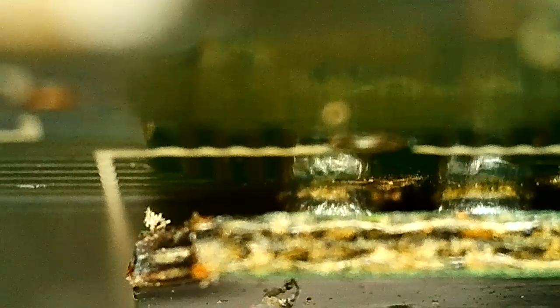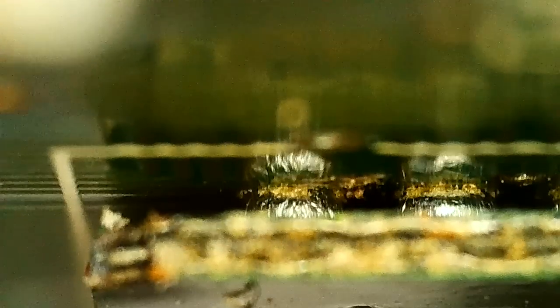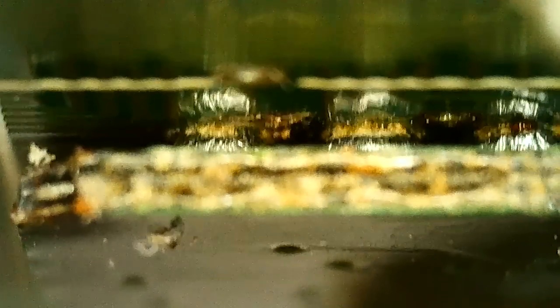But I actually think the balls are separated from the PCB, and that's why we're seeing this kind of cracked glass solder. Because if you touch it with your tweezers, like if you scrape a big surface around a MOSFET or something on a PCB, you get the same effect. So you need some mechanical force basically separating the old flux from the solder. So how could that have happened here? Well, if the balls left the PCB, that could have happened.